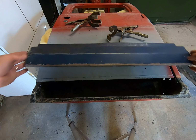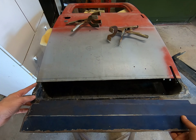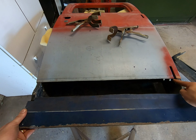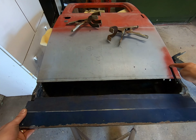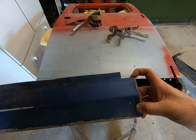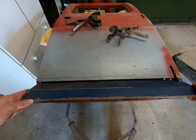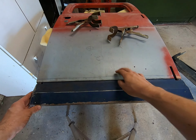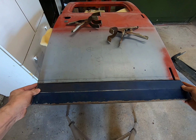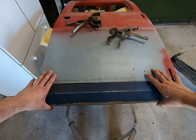Okay, so one thing I had to do here was, in order to clear the flange from the shell here and here, we also went ahead and cut around where this is the very bottom of the slotted hole here, okay? So you can see, cut that. It's a little deeper than it would be on this side, which is also cut. This will allow it to slip underneath the existing panel, push all the way up in there, square it up a little bit. We need to knock this side down a little bit, but we have where we want it.